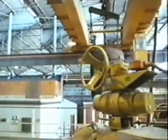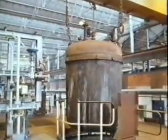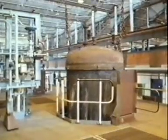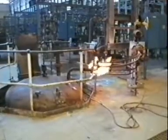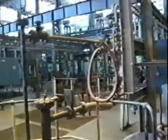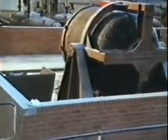Here's one of the steel vessels in which that reaction is carried out. It's lowered into a brick-lined oven which can be heated to a high temperature by gas burners. The air inside the vessel is replaced by the noble gas argon, then liquid sodium is run in. When the sodium's in, the pipe's disconnected and liquid titanium tetrachloride is added. The reaction vessel is heated for 36 hours, then allowed to cool and opened. Inside there's solid salt — sodium chloride — coloured by traces of titanium compounds, and dark-coloured titanium metal. The salt is dissolved in water, and the titanium is filtered off and dried.